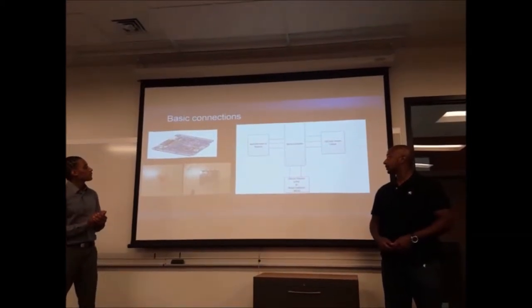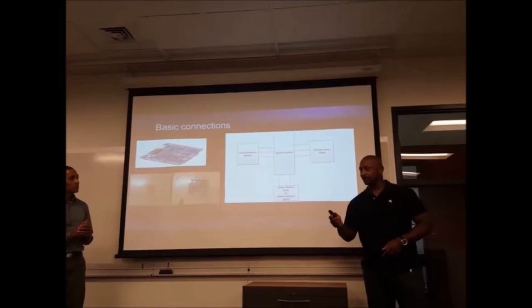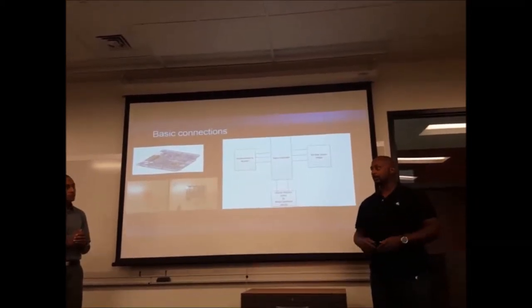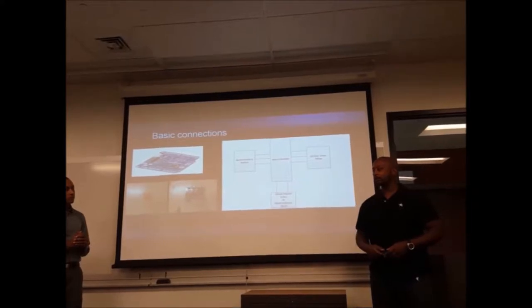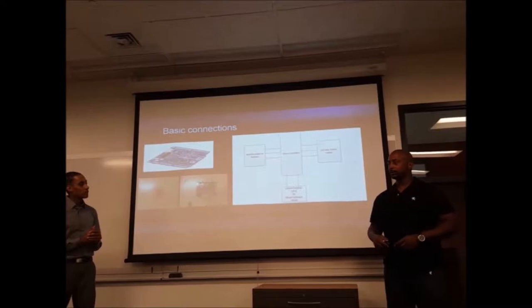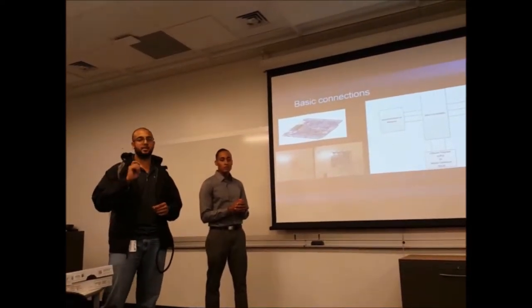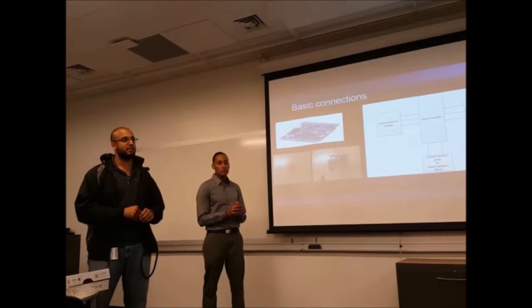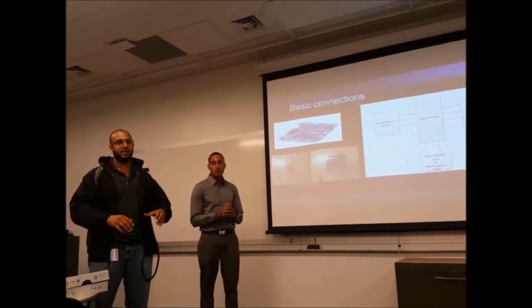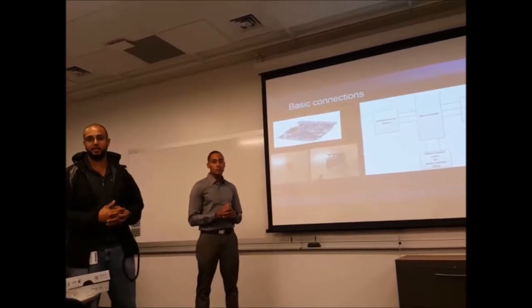Next. The lithium battery, same issue that Team B had with the ordering of the battery. So we're also running on AA batteries instead of 9 volts. It seemed to work better. The 9 volt was a little bit of an issue with the EL lights. Connected to the system that powers it, it would normally burn up. Too much would come out, and that would mess up the system, so we had to go with 3 volts.